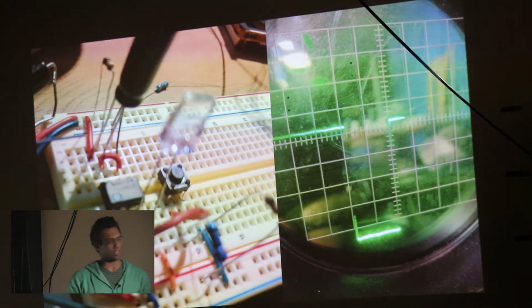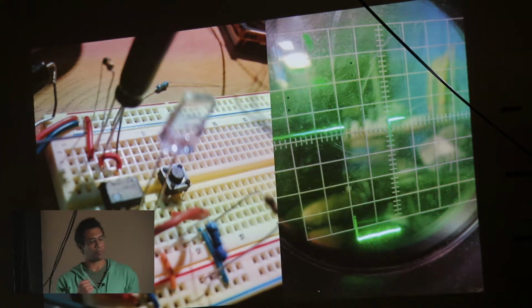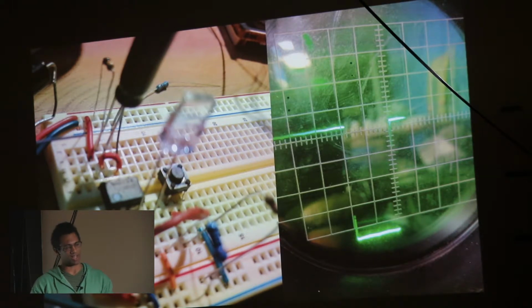But unfortunately, when you punched it, there was a delay in my code, because the Pi kept displaying the thermal warning on the screen, and I turned that off, but I figured that since it was displaying a warning, I should probably fix it. I had it all set up at this event, and you could punch it, but there was a 100 millisecond delay in the code to just keep it from overheating. If you didn't punch it at just the right moment, it didn't register at all.